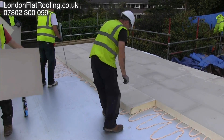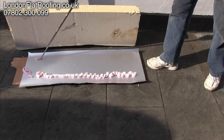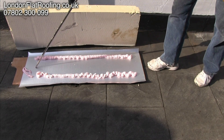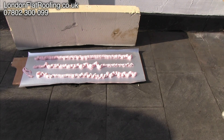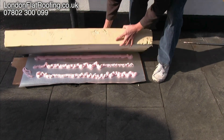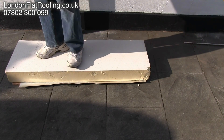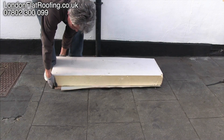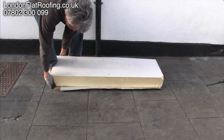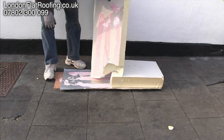This is my test area - a piece of ply with the vapour barrier stuck over the top of it. I then applied the adhesive over the top of that and put the insulation down, walked over the top of it for five or ten minutes just so that the insulation was tight down onto the vapour barrier, left it for a while and then tried to pull it apart. And as you can see, as I try to pull it apart, it breaks - it's got a good bond to it. So I've done the best I can to test this and make sure it works.